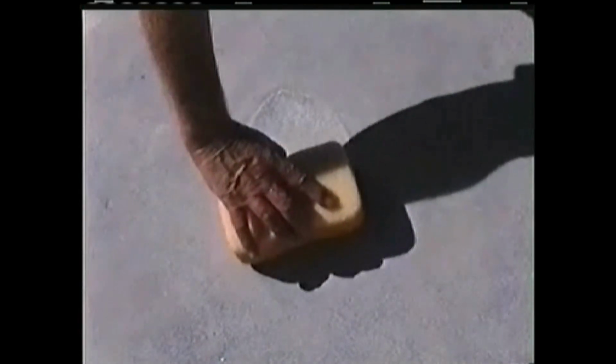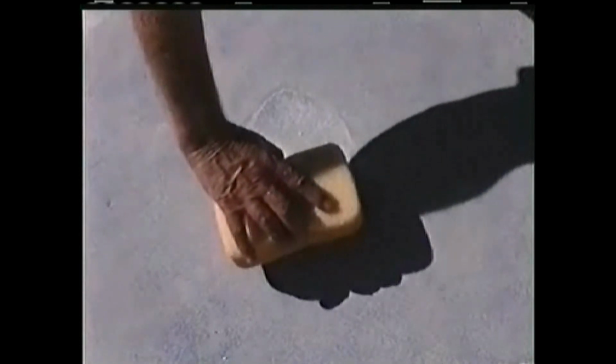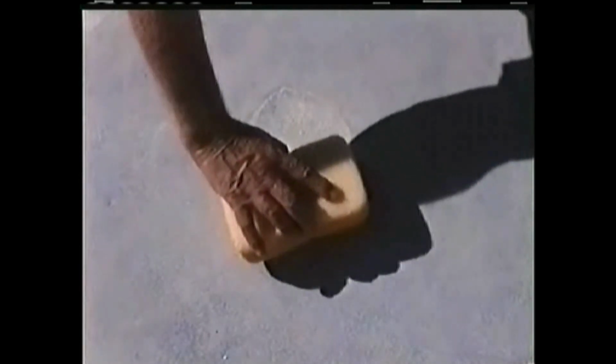After the patch stiffens more, lightly sponge to reveal the quartz color to match the surrounding area. If you expose too much quartz color in spots, lightly moisten with water if needed, and just trowel the spot again to draw the cement up to the surface.